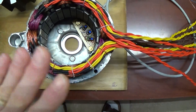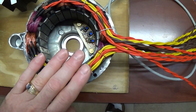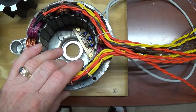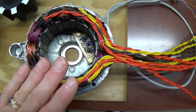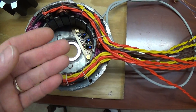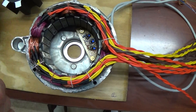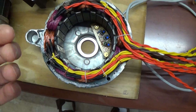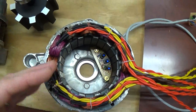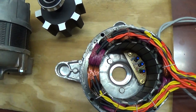All of this is to determine what work the flyback collection will do. First I'll be doing load tests on this motor, collecting the flyback energy into a capacitor, and determining the amount of power we can obtain from the collapsing fields of the coils while the motor is running, then compare that to just the regular standard motor.